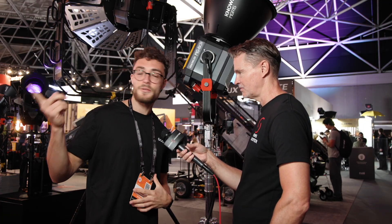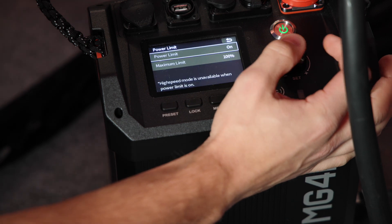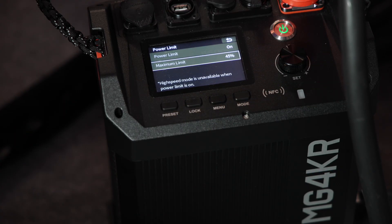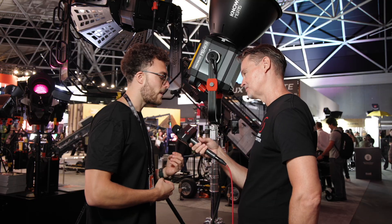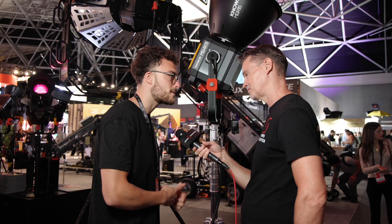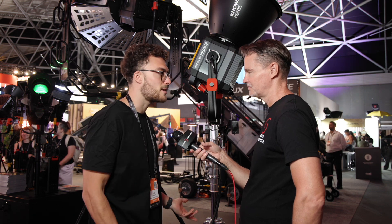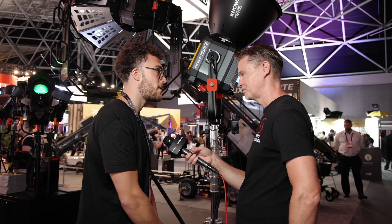And what's the power draw? You have 2400 watts on both. But if you want to use it indoors on a regular power socket you can, because you have a system built into the ballast that lets you limit the max power draw. It's the first time I've seen something like this built into the ballasts. This is also featured on the MG6K, the big brother of the MG4K series. You can use it from a CEE plug or in the US with standard outlets, and you can limit it percentage-wise or watt-wise depending on what your sockets can handle. If you have an old installation you can limit to two kilowatts, a new installation to three kilowatts — it all depends on how much you want to draw and how much you can draw.